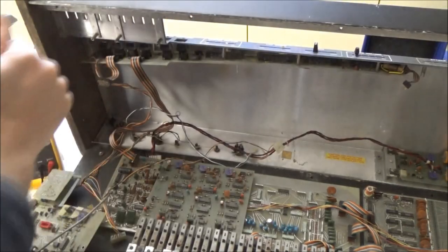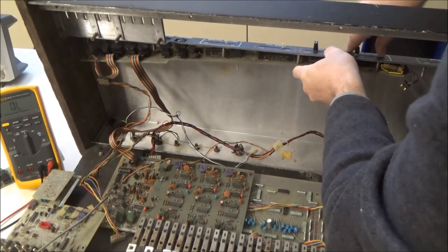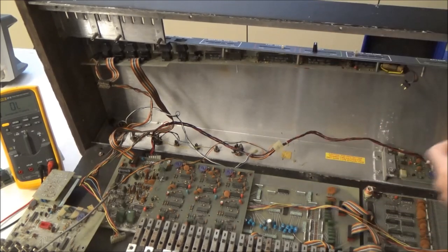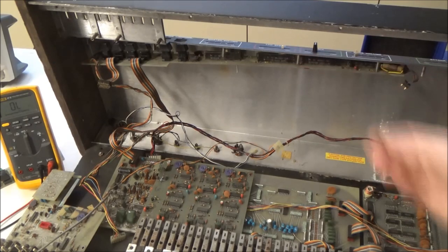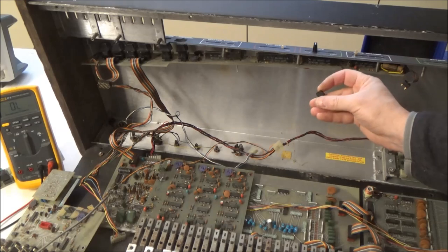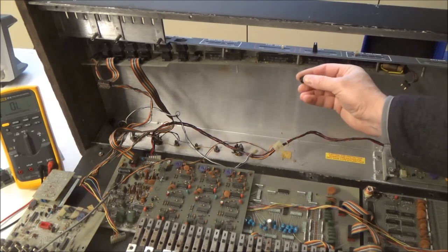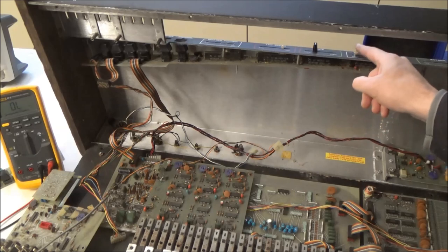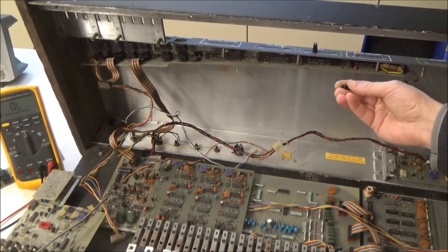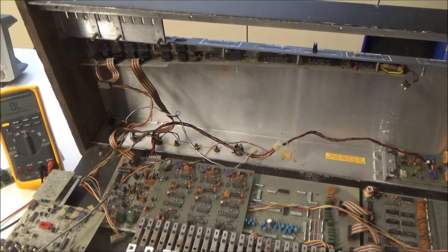Holy moly, this is really stuck on there. So these plastics have a tendency to shrink, even small amounts, but they can shrink over time. And these Mark II style, Omni II style slider caps can really get fused onto the old slider shaft, and actually replacing them with the replacement slider, sometimes the caps don't fit, and you need to file or sand the shafts down a little bit to get them to fit.